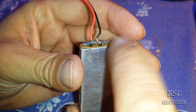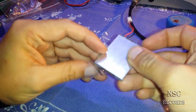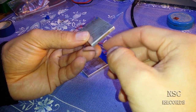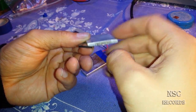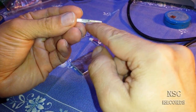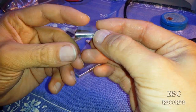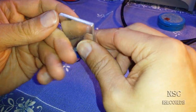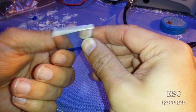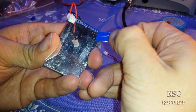I will now open the second battery. Like you can see, I just opened it very easily with a light touch and it just jumps out. Down here on this battery we have the plus — and this one was not really well soldered. It looks like a machine just went over it. You can see it clearly — this is not soldered right.